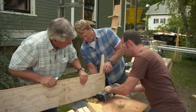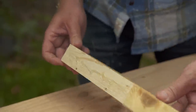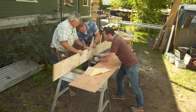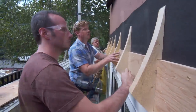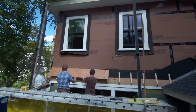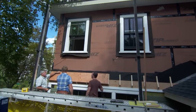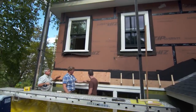So now we have a piece of three-quarter inch plywood that we're going to mount all of our curved studs to, and they're marked 16 on center to accept them. We also want to put a little bit of glue in behind it and then screw from the other side. Let's get these up on the wall. Now let's screw the plywood on — I want to keep it up about an eighth of an inch off the bottom. So now we'll screw this on, and the screws will pull the plywood right in and follow that contour. We fill in down there, and then all the way around the house, and we can start to shingle. Then crown molding right there. What do you think about that look? That's going to be great.